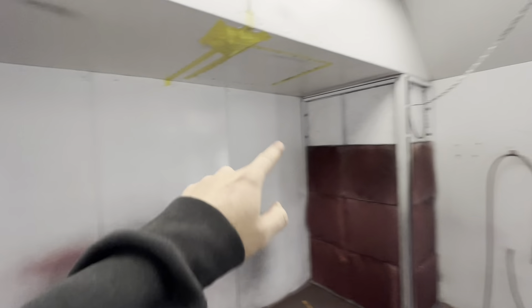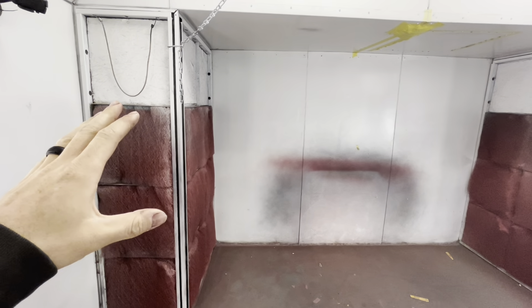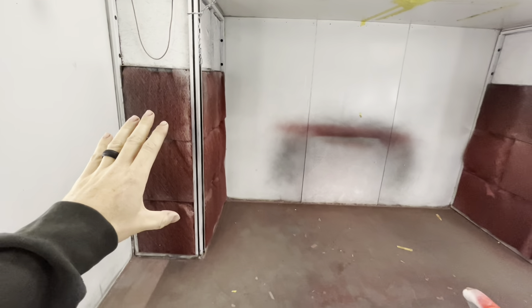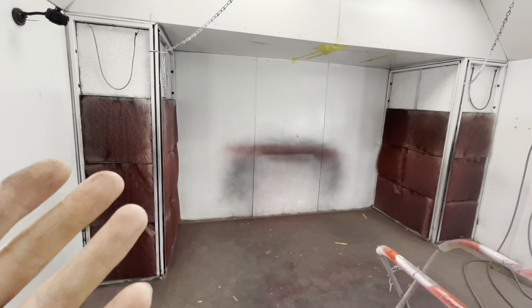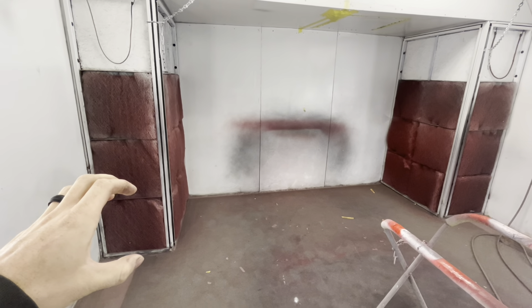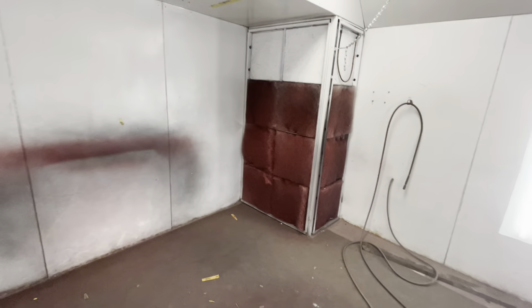If you can order them off Amazon or eBay, you'd be looking for exhaust filters for paint booth fiberglass. These boxes up here are plywood — exhaust filters do go there, but to cut down some of the airflow, it was flowing too much when I first got this booth, so I blocked them off. When you test your airflow, if you're flowing too much, you can cover it with cardboard and make it smaller. Some people will say that if you choke it down smaller it's going to move faster, but then it can suck less into it. So you're just going to play around with your setup, because there's not going to be a one-size-fits-all.